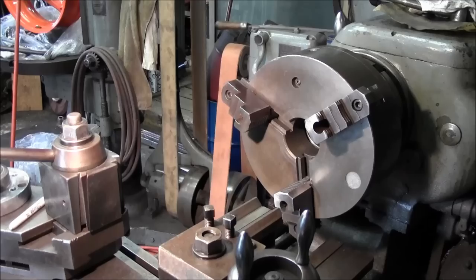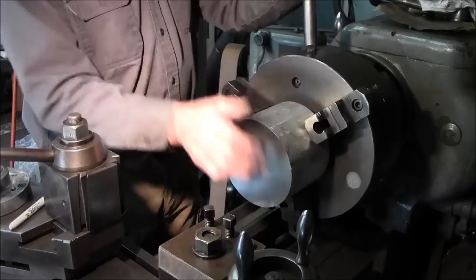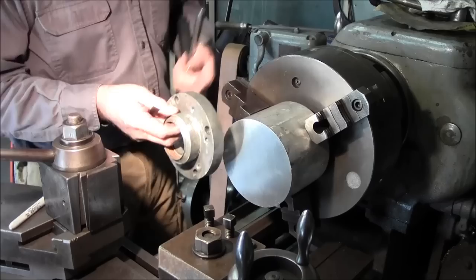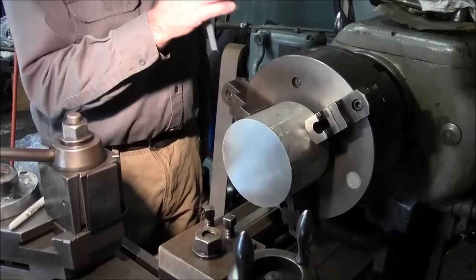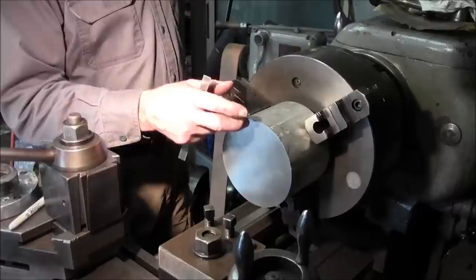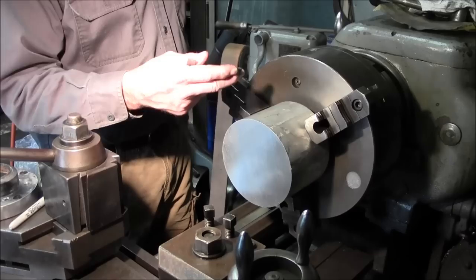All right, we went in and took the Inco saw and we took a piece off of that billet there. And our part's approximately about 2 inches long, and we want plenty of room out here. We're going to machine one whole complete side of this part, and then we're going to part it off, and then we'll be able to turn it around, locating on certain diameters that we're going to have set up to duplicate the axis or the spinning part true for our second setup.